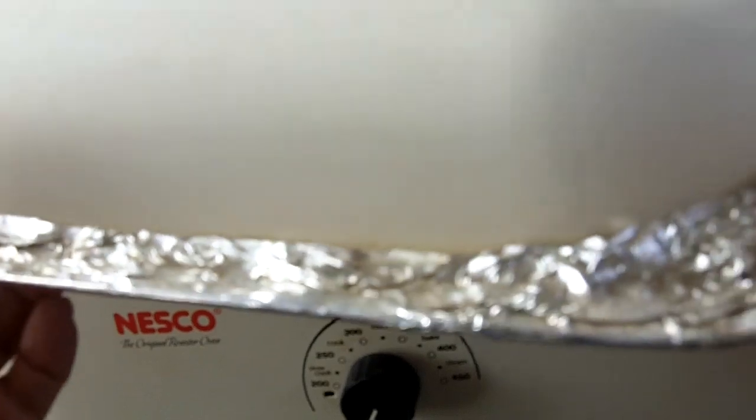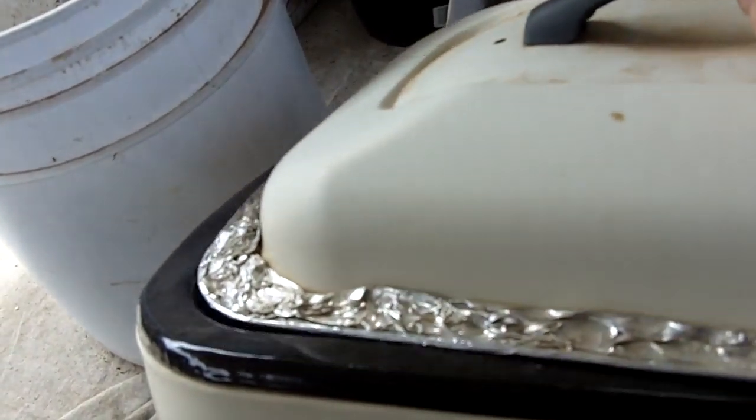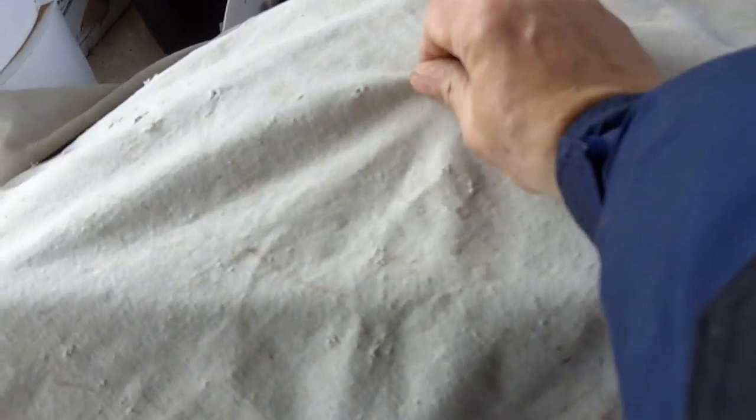The lid does not normally have this aluminum foil. What I've done is inside the lid I put some fiberglass bat insulation, held in place by heavy-duty aluminum foil. I cover it during the heating process, but the fit isn't completely airtight, so during heating I cover the whole thing with some muslin or canvas right over the oven. That keeps out drafts and prevents rapid cooling of the inside.